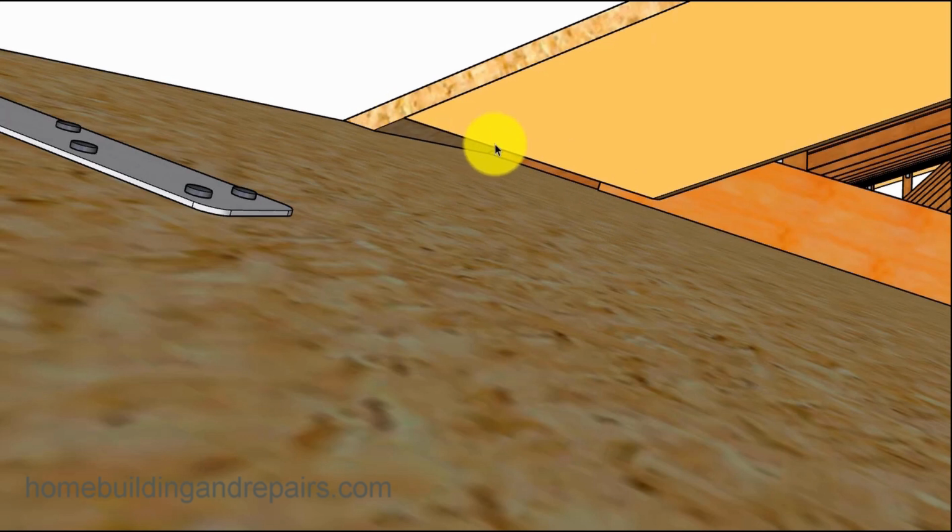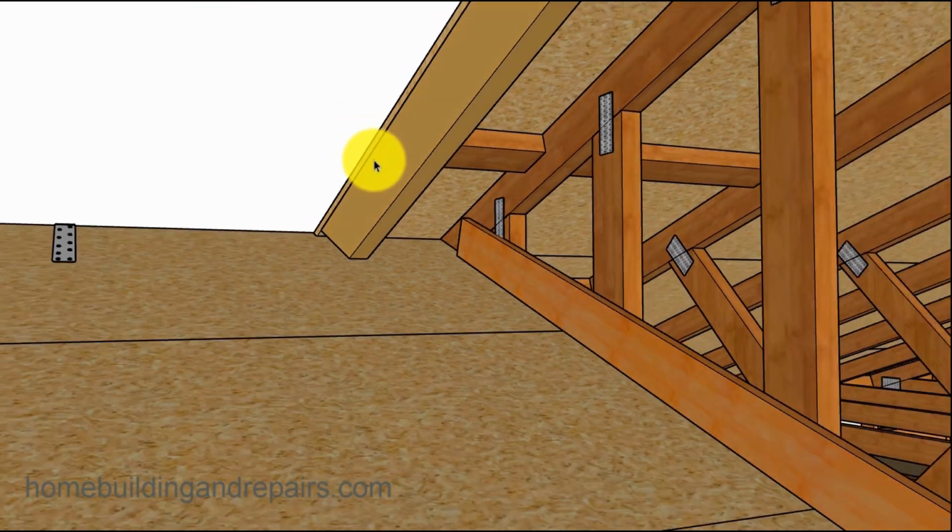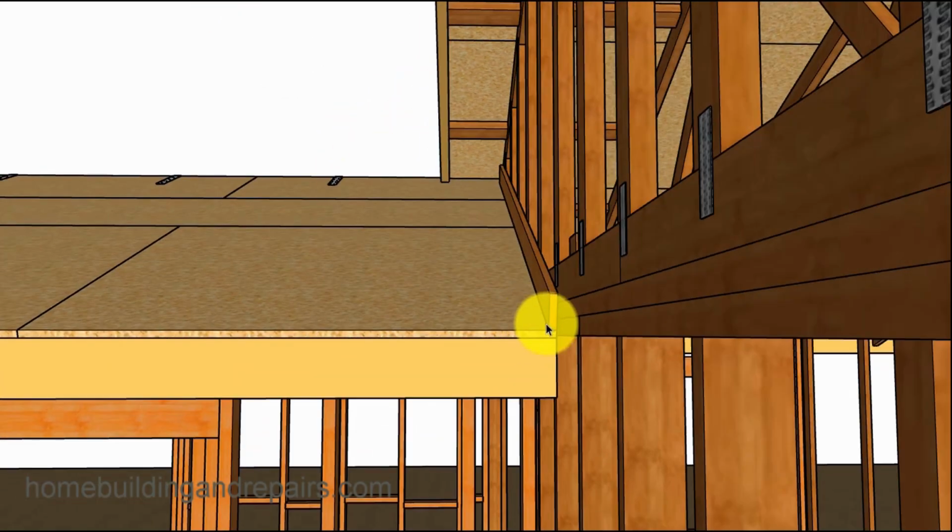And here's an example of the fascia board that we cut. Here we now have a 1-inch space, which would probably work out fine for composition shingles. And then you would roof underneath that, so your roofing materials would go under here. Now, if you notice, I have a 1x4 here. This is so that you can install some type of metal for the waterproofing. I say waterproofing, but I don't like to use that word. Water resistant.